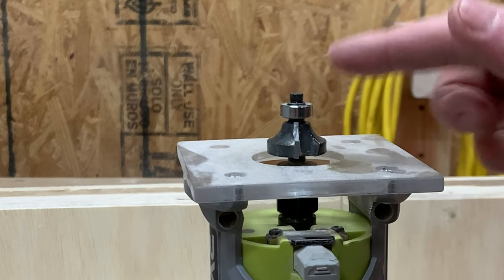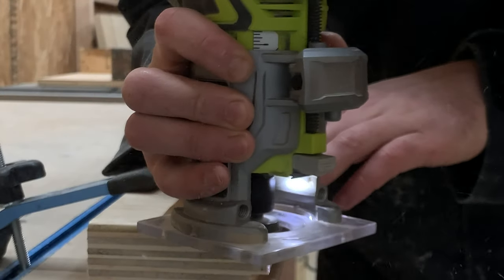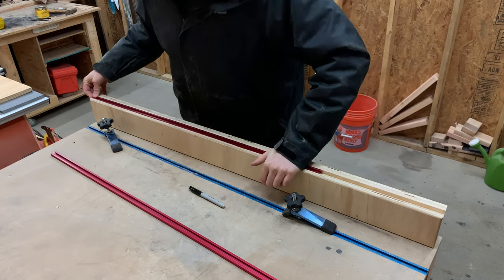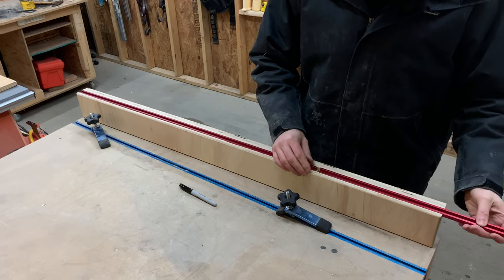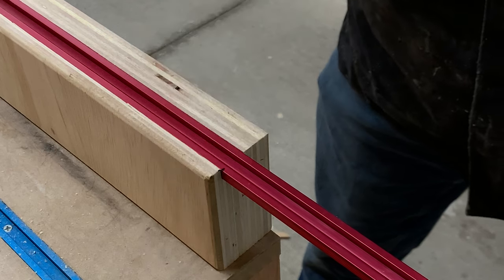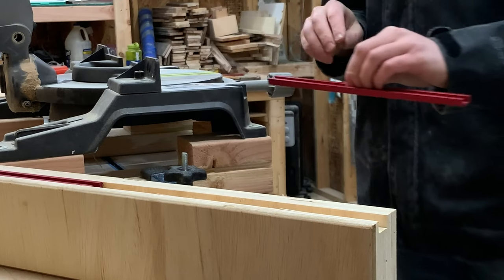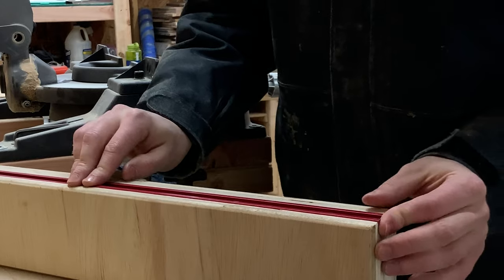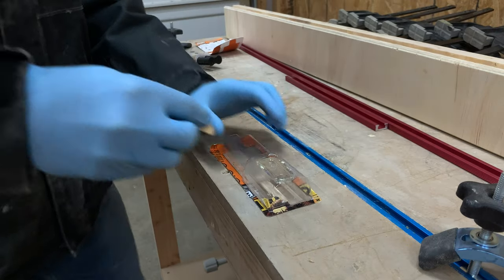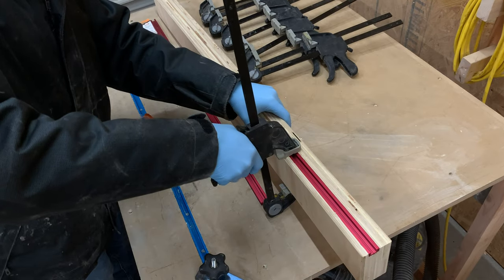To make everything more comfortable in our hands, we used a one-quarter inch roundover bit to smooth all the edges, then moved on to trimming the t-track to its final length. The t-track is made out of aluminum, which means it's soft enough for normal woodworking tools to cut — just go slow and you won't have any problems. We did a dry fit, marked where to cut it on the miter saw, and be careful because the cut edge will be sharp, which is why we put it on the inside. To hold the track securely, we used Gorilla Epoxy, squeezed it into the tray, mixed it, and spread it in the groove. This stuff sets up fairly quickly so remember to move fast.